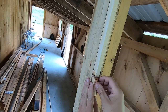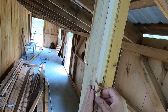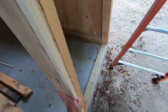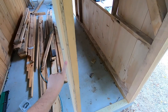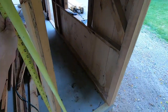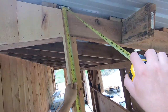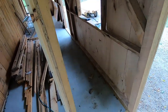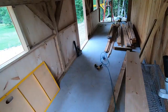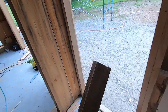If we do it like this, you won't see it — put it back together like a puzzle. So let's get our overall length here, and then we can also put a 2x4 in here for our nailer and figure out how many sheets of siding we can cut. We need 86 — that is going to be 35 and 3 sixteenths. I believe we have a leftover 2x4 right here from somewhere else we can use.